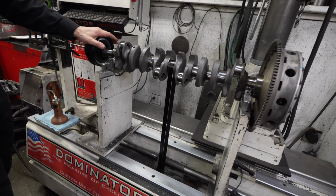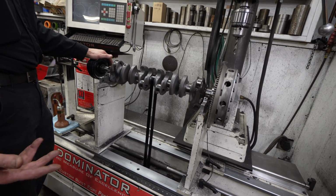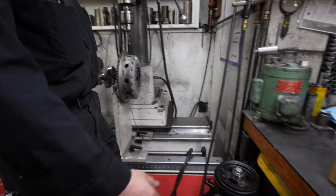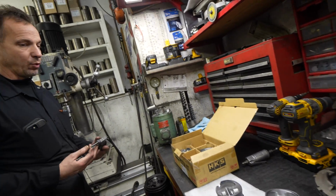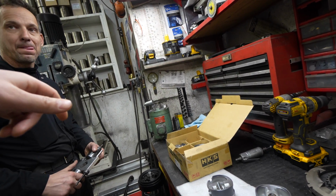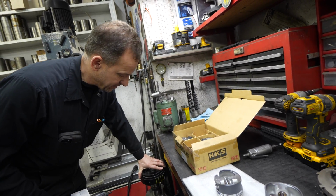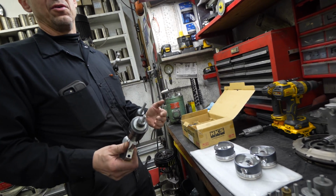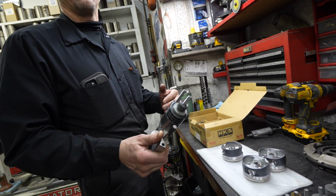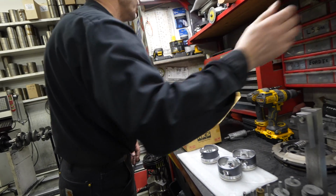Well, when you do a V8 motor, you actually have to build what is called a bob weight. So the bob weight's going to be 4 of these, and you got to weigh all the components. Because that's what I saw. I saw those attached to whatever engine you were balancing when I came here the first time. Correct. So V8s, V6s, anything like that. Anything that's a 4-cylinder, inline 6 cylinders typically. Some 6 cylinders you need bob weights on. Just every motor is a little bit different.